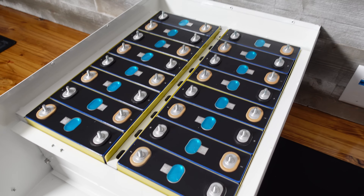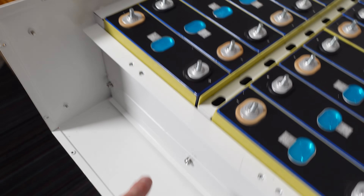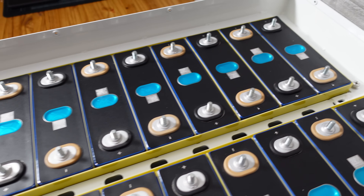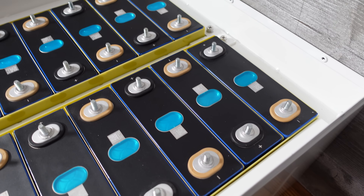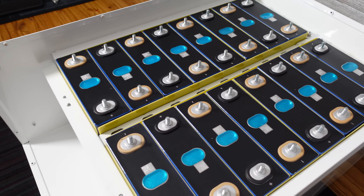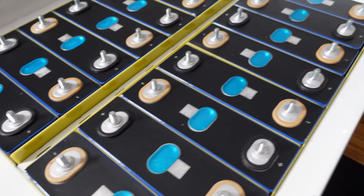The cells are in, and I did end up leaving out the two pieces of foam — there was no way to fit that foam in here; you can see how tight it is. It even squeezed the cells in a little when I was tightening the bolts, to the point where I was questioning whether to put them in at all. These are used cells that have been used for two years and sat for a third year, so they expanded just a tiny bit and still fit. But I will caution you: if you have expanded cells, you should never under any circumstance compress those cells once they have expanded. If you've got brand new cells, you shouldn't have any problem fitting them in. It just looks very professionally done compared to the DIY approach with fish paper and foam.